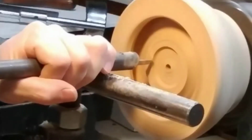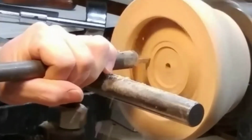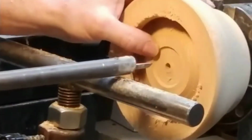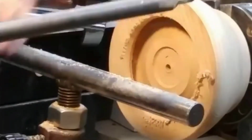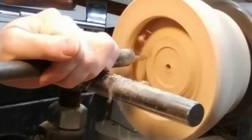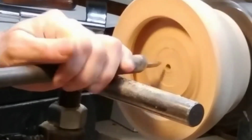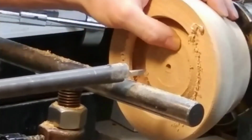Mike, how do you sharpen that cutter? Do you just do the top, or do you do the main? I do the bevel. Mostly the bevel. When I'm honing, I try to hone with that credit card diamond hone. I still do the bevel. I hold the card on the heel, and I tilt it up until the cutting surface is touching the diamond card, so that both the heel and the cutting surface are touching the hone, and then I rub it up and down.